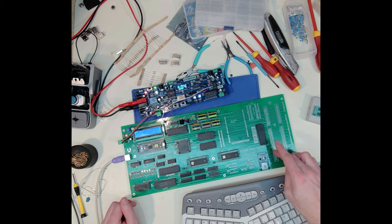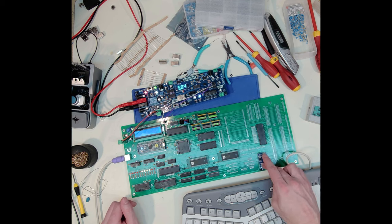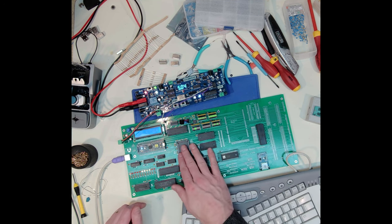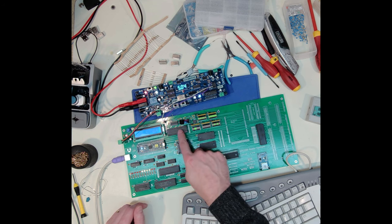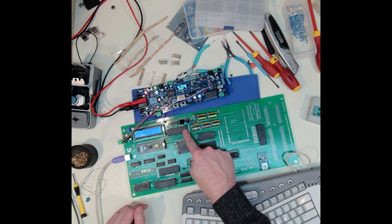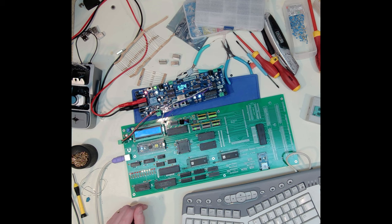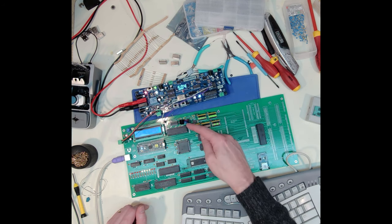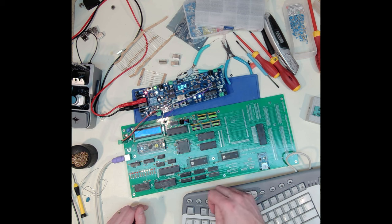I have the VIA in place. I could start reading the SD card. What I know is working at this point is RAM. I know the ROM processor is working. I know this is working. This is PPI number 1 because my keyboard is working. Also, I don't know if you can hear or not, that PC post speaker is working fine.